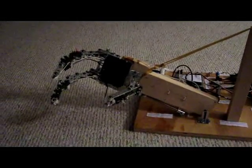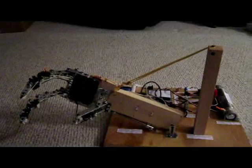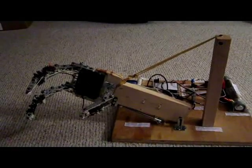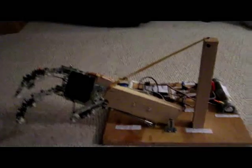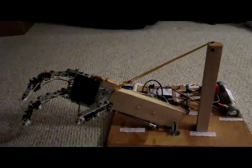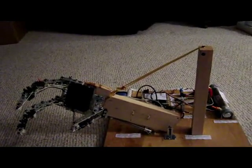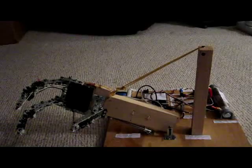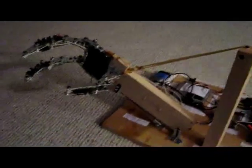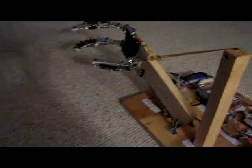The way this is angled, the weight of the arm is being counteracted by this elastic band. The amount of lifting force — it's at around a 30 degree angle — so a 30 degree angle of the 54 Newtons of the piston. That's the maximum lifting force that it has.